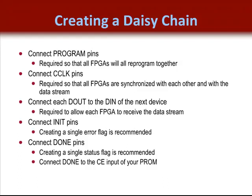As an FYI, check your clock termination and the specifications for the clock signal with the user guide. Again, many customers create problems for themselves when they do not meet their configuration clock requirements. This is probably one of the most frequent technical issues customers experience. They simply do not have a sufficient configuration clock, and the done pin never goes high, and they're not sure why.